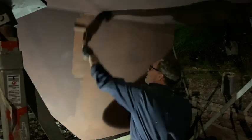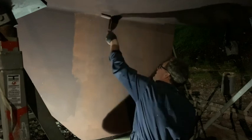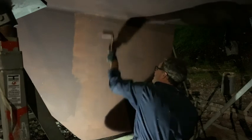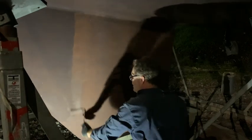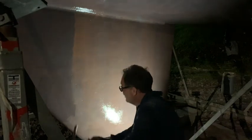Really small batches. We started off doing a litre at a time and by the end with big rollers it was almost impossible to put on — it was going off and going on really thick. Recommendation: use small rollers because they take less energy to push and this stuff is really tacky. One coat when we mixed up a whole litre with two big rollers and two big trays — we were exhausted. With small batches I've been at this for hours and hours and although I am tired, I am managing to keep going. That's what we're looking for.